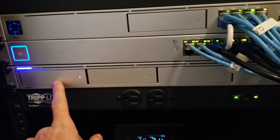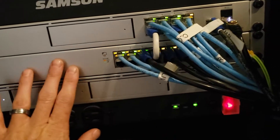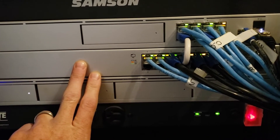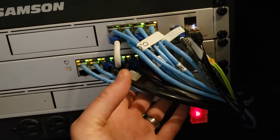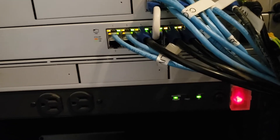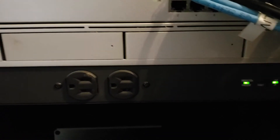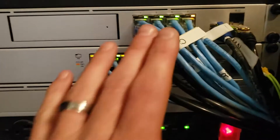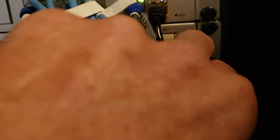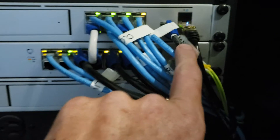The NVR is running a 16TB Ultrastar hard drive right now, and he's going to get more. We have a 150-watt POE switch — all his stuff is plugged into it: his access points, two access points, and three cameras down here. I'm using an uplink right now to the UDM Pro.